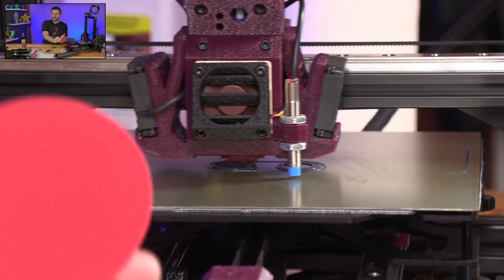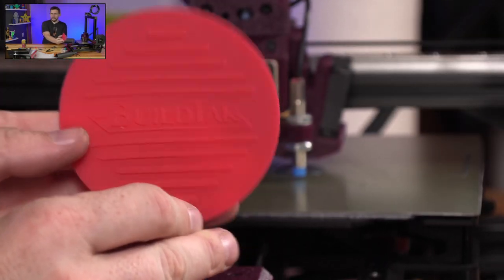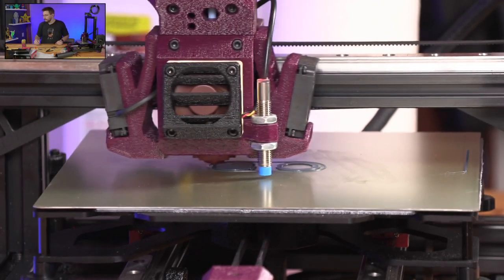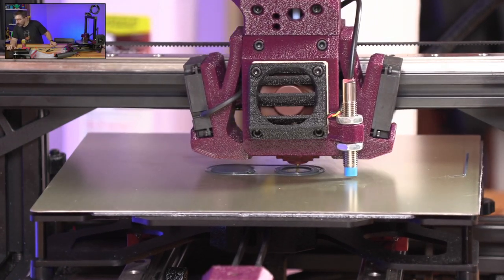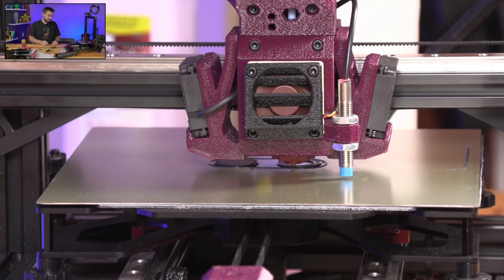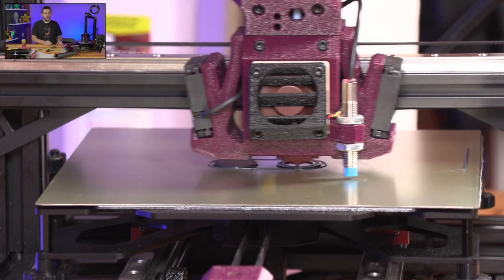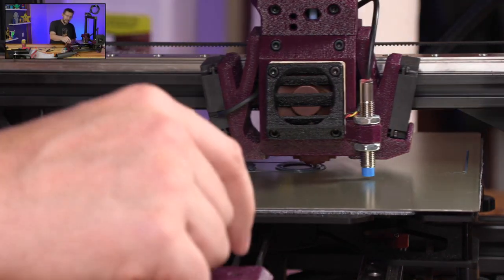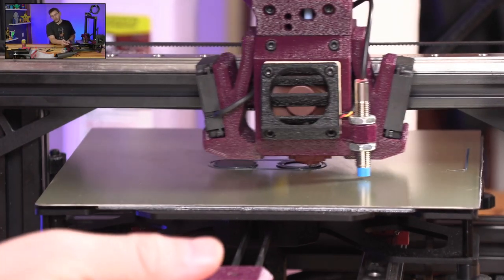So I wonder what this is. This build tech thing? Focus. Kind of a silicone sort of, I don't know. But it came with it. We shall see. Joel, hey, another Joel. Joel Heberlin, did it stop clicking? No, there's still a creak. And I don't know what that creak is, but I can feel it. I can feel that clicking, like something's tapping or hitting something within the Y axis. Could be that there's a bearing out. It could be a bad bearing, maybe.